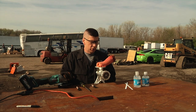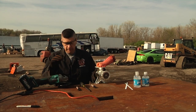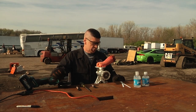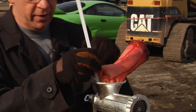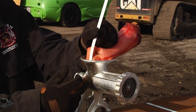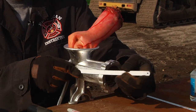After we get those lines made, we're going to start thinking about how we can inadvertently hurt this person during the removal. The blade on a right-angle grinder spins really quick. So one thing we do is take hacksaw blades and remove the teeth on a bench grinder. We're going to insert those as shims whenever we make our cuts. We'll put them in vertically and cut in line with the line we've drawn on the machine. Once we get it disassembled and make our horizontal cuts, we'll do that as well.